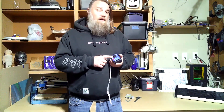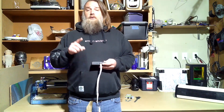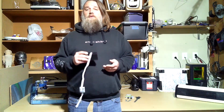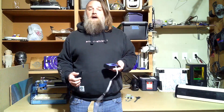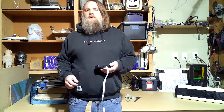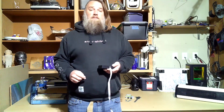You cannot have the offline controller and machine hooked up via USB at the same time - it's not going to work. Only one can be hooked up at a time. Second, on the SD card, you're going to need to make sure you have two files: Probe and Spindle Laser. Those need to be on there for the offline controller to work. We will be using the offline controller today without the Probe. We will be using the paper method to set our Z, and we'll be using a drag bit, a three millimeter end mill, and a one millimeter end mill.